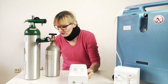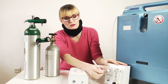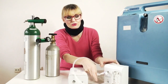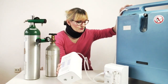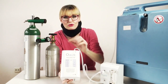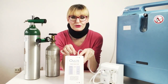This is the last step. If I have my external low flow regulator, I can attach it to the oxygen concentrator, and then connect it to the oxygen-in port on the ozone generator. If I turn this on — it's not plugged in right now — I would be feeding oxygen at a low flow into the ozone generator. And the ozone generator does exactly what it says: it generates ozone from the oxygen that you feed into the machine.